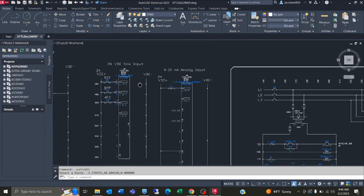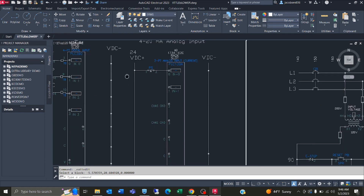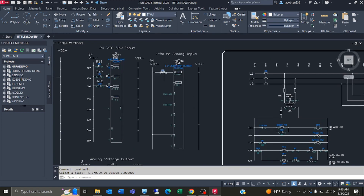Going over to our next card here, I got my pressure sensor just going straight into input 0 here, and we have voltage going into this 6 port. We want to bring in this pressure sensor so that it can communicate with my PLC and be able to tell the motor how fast to run to keep up with the pressure in the box of the little blower.